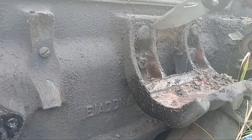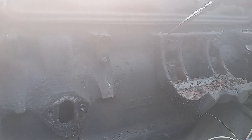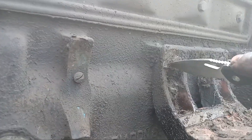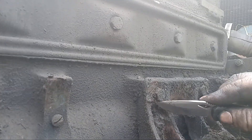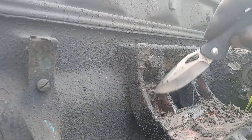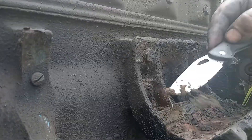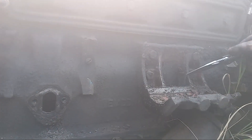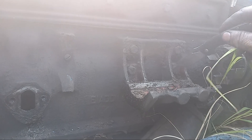This injection pump on this tractor was from a Super Major and it ran 2000 RPM. With the mechanical governor they could run up to 2250, and maybe some ran even faster. The Power Major ran 1800 RPM, and the original Fordson Major diesel ran 1250 RPM.